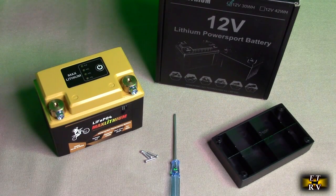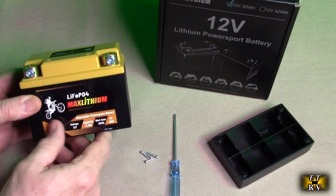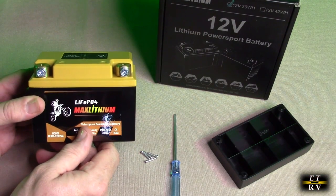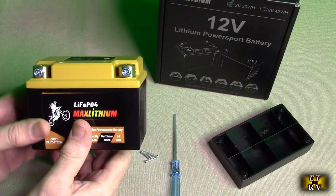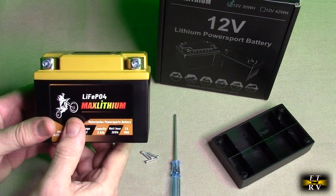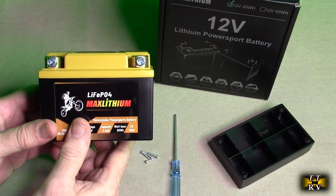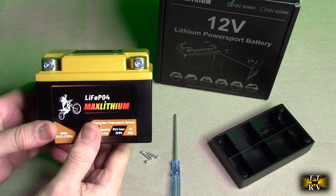So what's the big deal about lithium iron phosphate batteries? They're better than comparable lithium ion batteries. They're less prone to combustion and thermal runaway, making them safer to use in your home or in your ATV. They have a longer life cycle — this battery outlasts lithium ion by up to five times longer. Lithium iron phosphate is a type of lithium ion rechargeable battery, but the benefits over the more traditional cobalt-based lithium ion batteries are increased power output, faster charging, reduced weight, and longer lifetime.